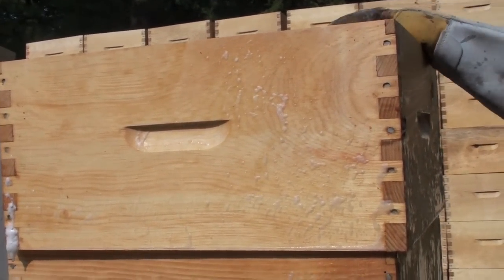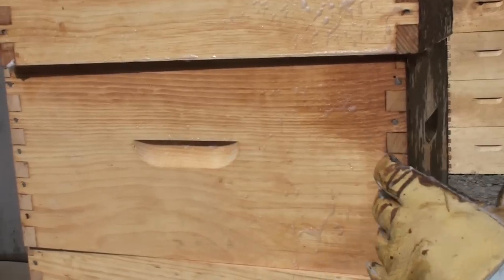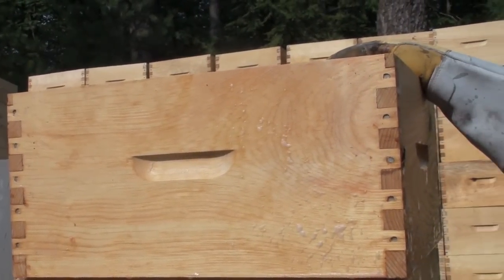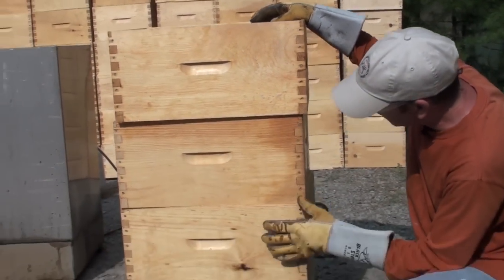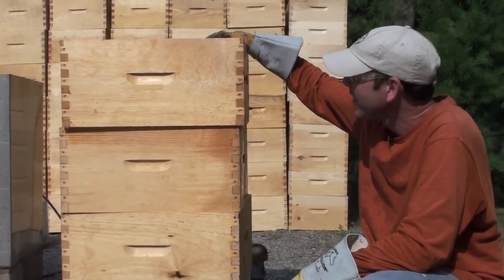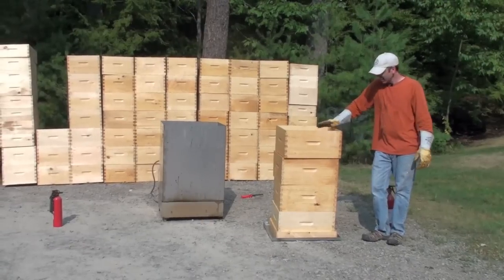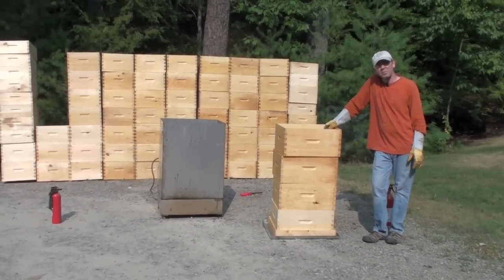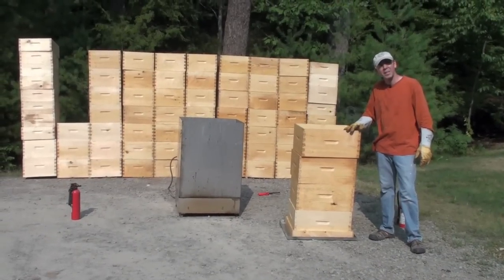This is one of the things about rosin and microcrystalline — when you add those to your paraffin mixture, it prevents bleeding. Plain 140 melt point paraffin will leave your boxes when it's 100 degrees out — it'll bleed out because it doesn't have that adhesion, and it'll leave them slippery. Adding the microcrystalline wax provides that adhesive property and binds it into the wood. You can see they were wringing wet but the wax is drawing right into those pores — that's what we're looking for. This will outlast a paint job easily — everything I've read says 10 years and perhaps 20 if you're kind to them. They'll be weatherproof and should last many good years of service. Good luck with your wax dipping.